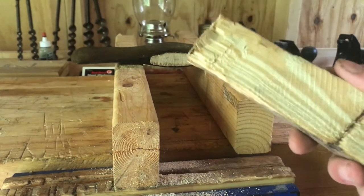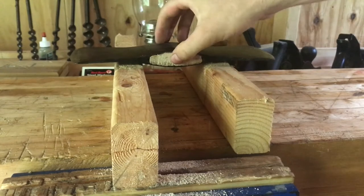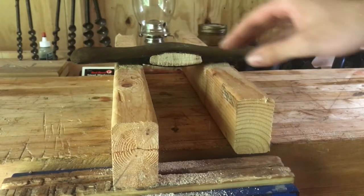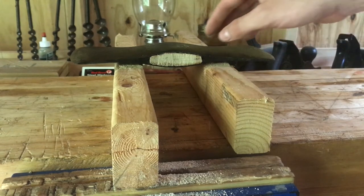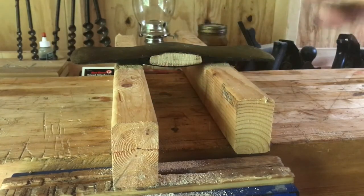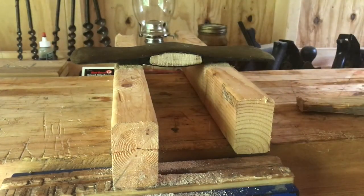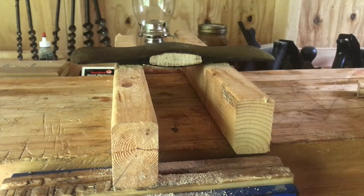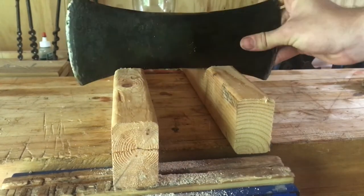You're going to have to make essentially a punch. If you have steel punches for steel working, those will work just fine. Generally people say to drill the wood out, but I don't prefer to do that because if you're not careful enough you can end up damaging the steel. So what I do is cut it really close and then take the rest out with a punch.